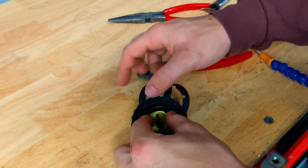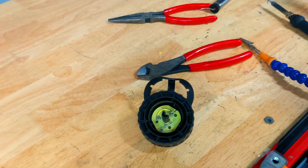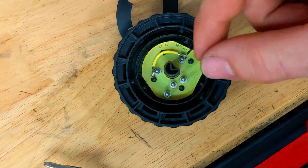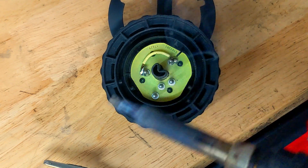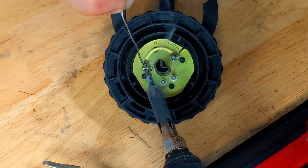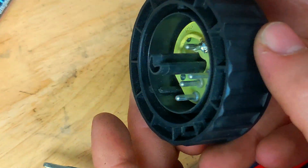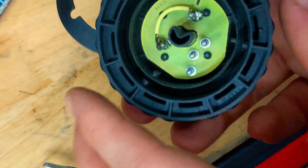Now we take our wire and place it on top of the pins so they're touching. Just like that, the wire is laid in there and balancing. We're going to heat up the pins, add a little fresh solder, and it should make a really solid welded connection between those two. And there's our final product — the pins are nicely soldered, the wire is flush against the green circuit board. Be careful when soldering so the iron tip doesn't hit anything plastic and melt it.